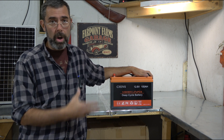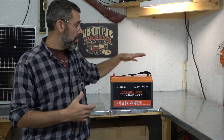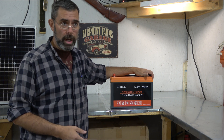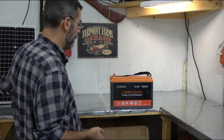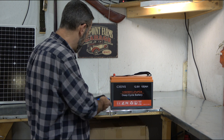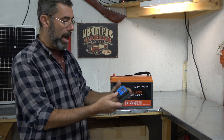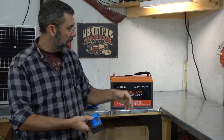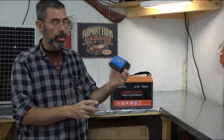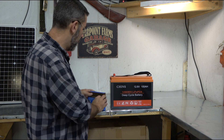I've now got two solar setups. We have one that runs all of our off-grid radio gear - an off-grid radio station and communication setup. This will be the second battery that goes into that, so I'll have 200 amp hours of 12 volts with 400 watts of solar coming into it and a charge controller. That charge controller is really simplistic - I actually have four or five of these that I keep in a Faraday cage as a backup, and these are on eBay for like $8. They have USB charging, so for walkie talkies or whatever you can charge directly off of it, charge your cell phone, and you can run 12 volt appliances directly as well.